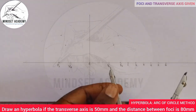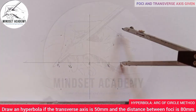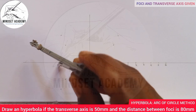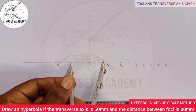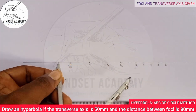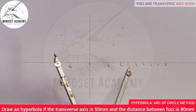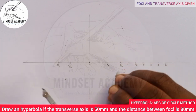Come again from V1 to point 3, place at F1 and F2, and strike arcs above and below each time. Then from V0 back to point 3, place at F1 — intersect this line and also this line. Then interchange it: put at F2, cut here and below, and where they meet will be the new generated points.